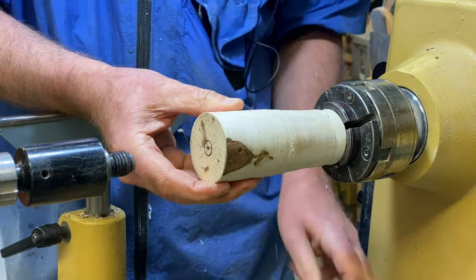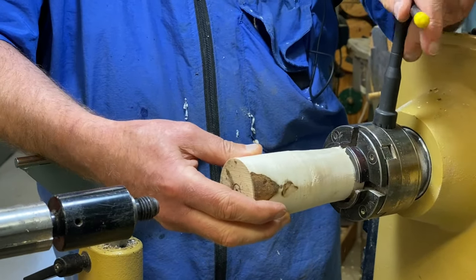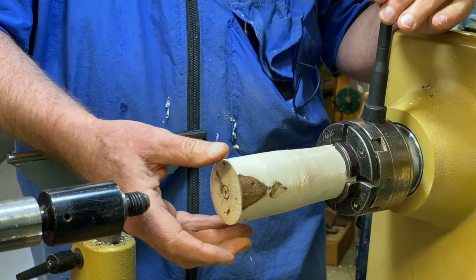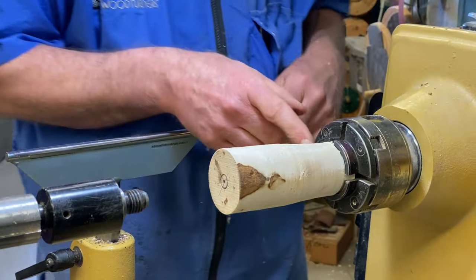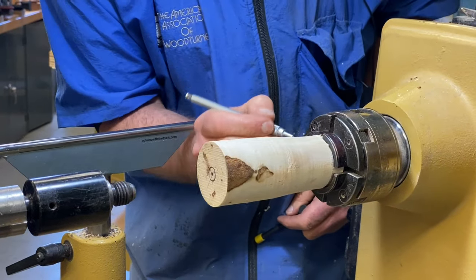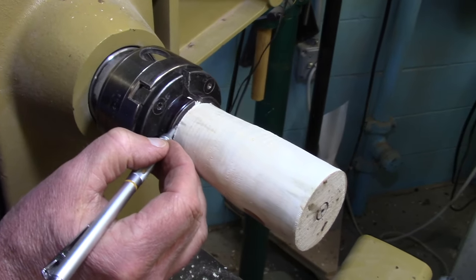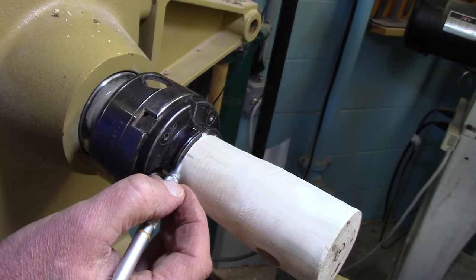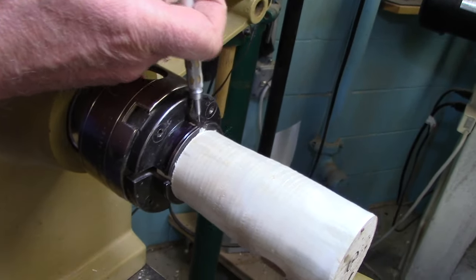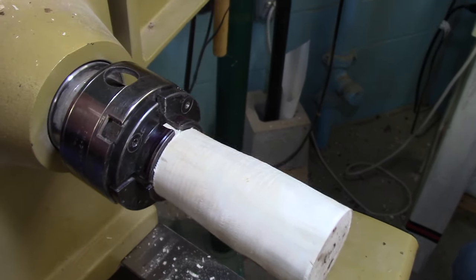So, doesn't fit. Install the chuck key. And I'm going to tighten this down just to the point so that it doesn't fall out. Right there. And you can see the jaws, the shoulder of my dovetail is right up against the top of the jaws. So I have contact there, which is important. Then my angle is pretty darn good. I don't see any daylight there, so with my dovetail angle, I have a lot of surface contact, so it's a very good grasp.